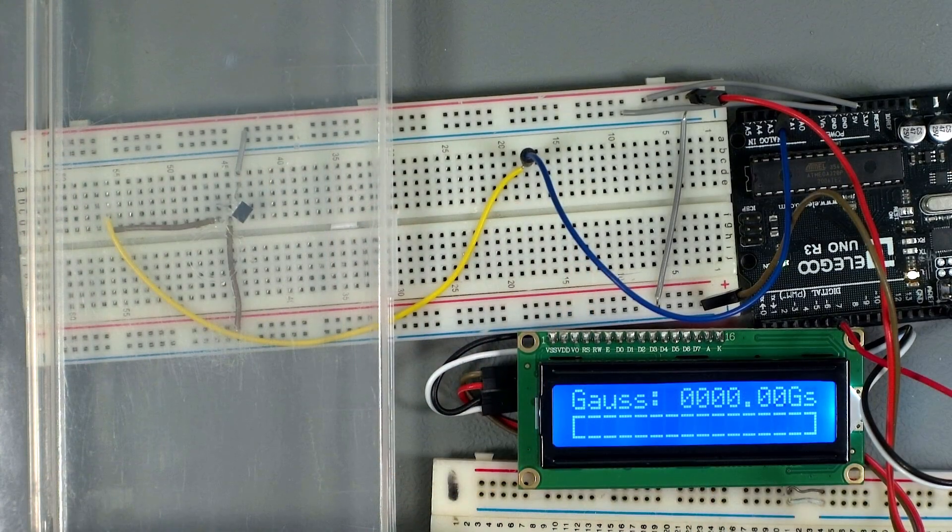First, I think we need to find a way to understand how strong these magnets actually are. What I've set up here is a very crude gauss meter — that's the measure of magnetic strength. This is a 49E Hall effect sensor whose output voltage varies with magnetic strength; it can also tell the difference between a north and south pole. I've got this connected up to an Arduino Uno and an LCD screen, and with a little bit of maths I can make it display a rough estimate value of the strength. I've got a transparent box over the top so I can measure them all from the same distance to the sensor, as the strength changes with distance. And that sensor is quite sensitive — see how even the magnetic tip of a screwdriver is detected.